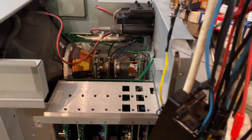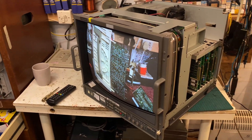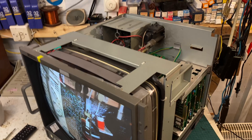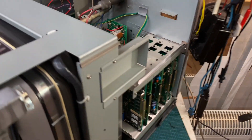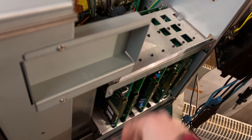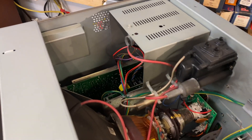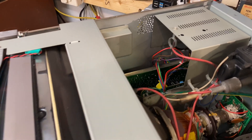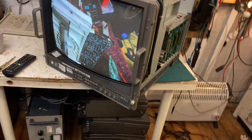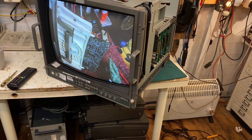You've got a lot of empty space in here, so I'm sure you could fabricate a bracket and mount a loudspeaker. You can use one of the unused holes for a volume control — something like that could potentially work. There's 12 volts all around the thing, so you can make that happen fairly easily. Make sure that you do clean the edge connectors on these sliding boards — they have a habit of getting dirty. Watch out for cold solder joints on the back of the edge connector board; there's a lot of weight on these and you will find broken solder joints. Also make sure the power supply has had its solder joints touched up, given the amount of hours these things see in broadcast settings.